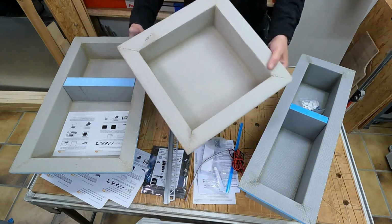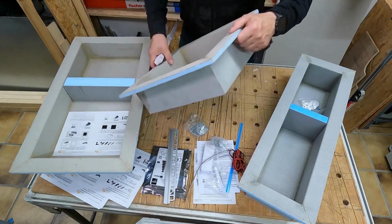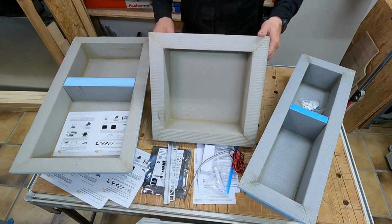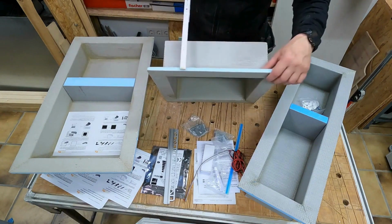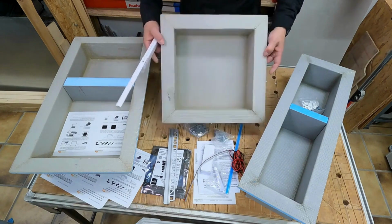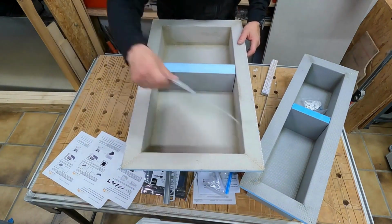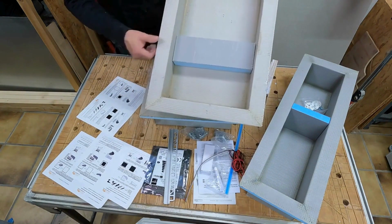The material is a hard foam. I won't mention the name now. It is a hard foam with a coating commonly known in the bathroom area, often used. The material thickness is 12.5, matching the standard material thicknesses of gypsum boards. They are available in 30 by 30, but they are also available in 30 by 60. For those who prefer something a bit larger, choose this variant.